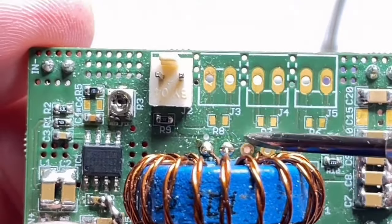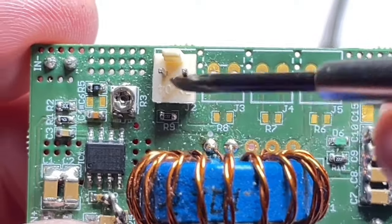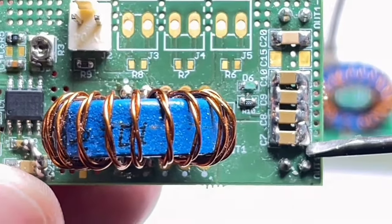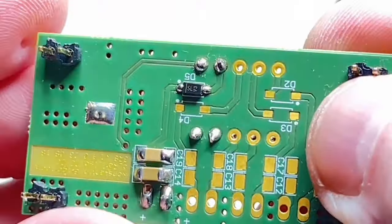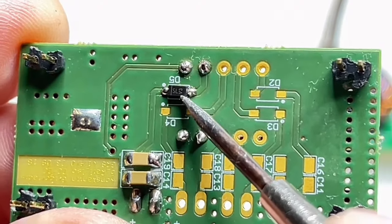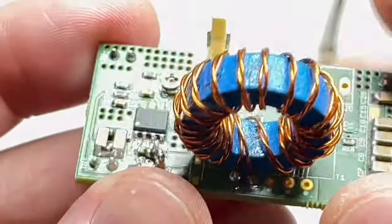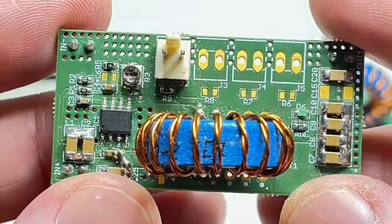And here on the top you have the minimal load resistors to give you 5 to 10 milliamperes per output. On the right side, you have the output capacitors. On the bottom, we have the Schottky diodes for the isolated outputs and the 2 capacitors. That's it. I used it a lot, and mostly on power supplies.